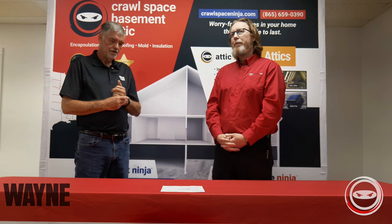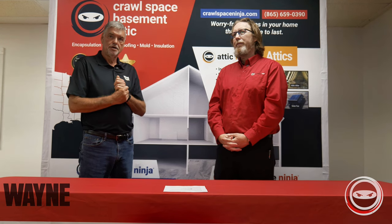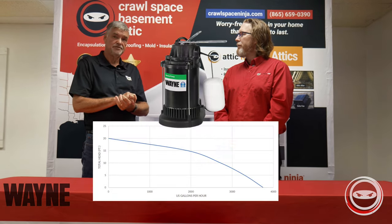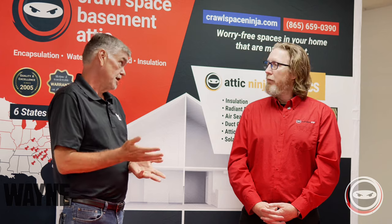What is it that Wayne Pumps do and how much water can those pumps move to help that interior waterproofing system get that pressure off of the foundation? We have several different horsepower products. A third horsepower product can remove, with an elevation of 10 feet, up to 51 gallons per minute. That's a lot of water.